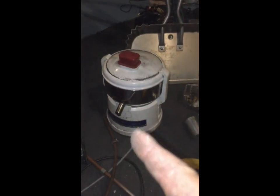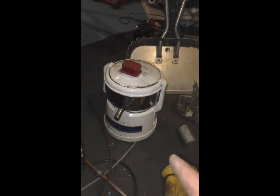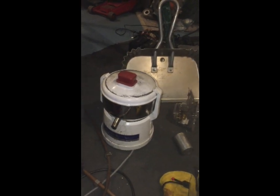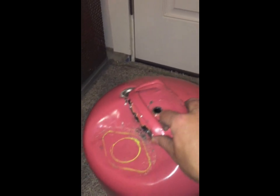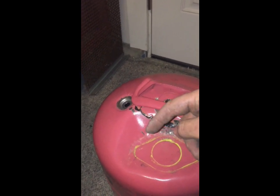And from there, it's going to flow into a centrifuge, which I haven't really finished putting together yet. And that's the centrifuge. It's going to separate all the heavy particles out of the oil, and it'll be the last filtration step before it goes into the oil management block. So it'll go from that to a collection tank, and the collection tank is right down here, and this is actually an old helium tank for filling up balloons. I figured this would be the perfect use for it. So it'll drop into this tank, and then a pump is going to pump it out of this tank